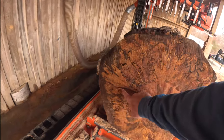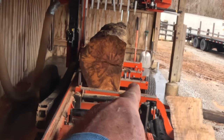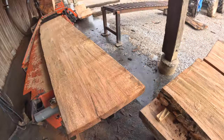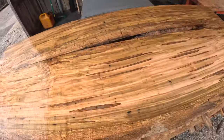This wood right here — this whole slab is going to be a waste. But that doesn't mean I can't get that one and that one. One of the important parts, as you can see, is where I stayed out of that big pith crack down there, so it's only going this far into the slab. I always cut my slab about six inches over long — that piece comes out, and this is going to be perfect. Yeah, that's gorgeous.